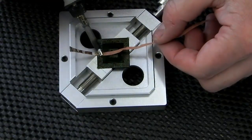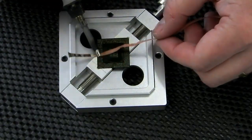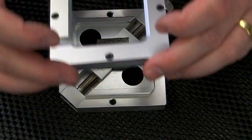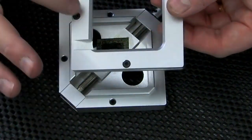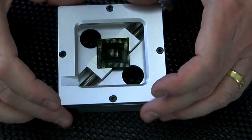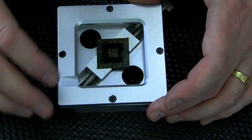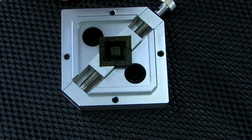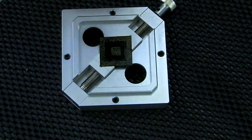This was originally bought because I was going to buy, I think, 90mm stencils that would fit in here. Sorry, the stencil would fit in between this. There's Allen screws in here, and you then lower that down onto there and that holds the stencil in place, and then just sprinkle the solder balls over it, and pour them out through there just by tipping it back out. But in this case I'm just using it on this really clingy rubber mat, so I've got a nice stable workplace.